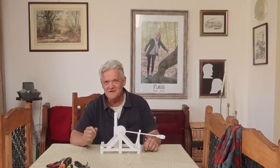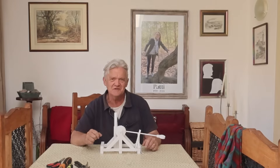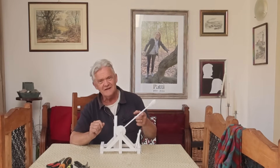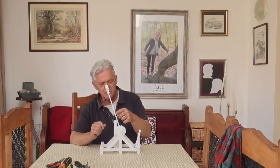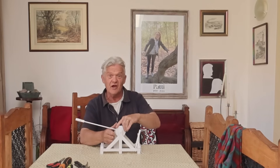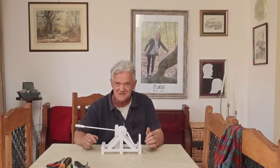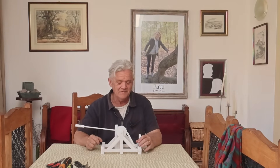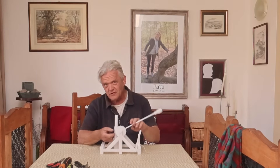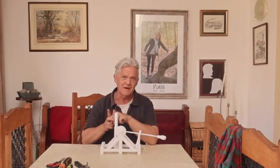We've been playing around with da Vinci's catapult and we replace the springs with magnets, using magnets as a spring. The more observant of you will have noticed that it's quite easy to do that, but there gets to be a point when it starts to get harder. As you start to press it together it gets really hard until we get it in position. When we release it there's quite a lot of push at first and as we saw, that push falls off quite dramatically.